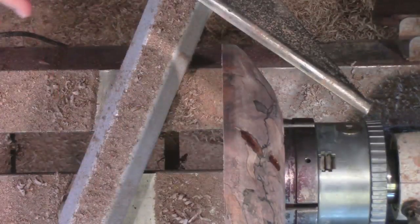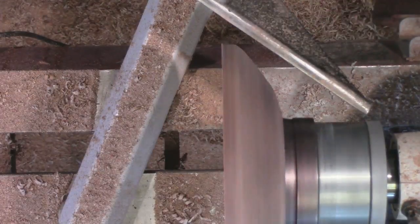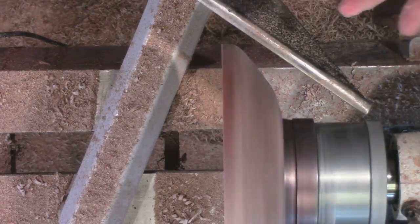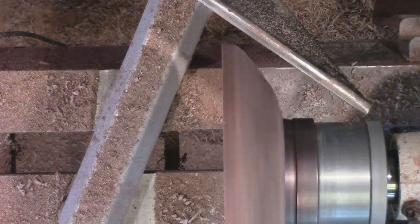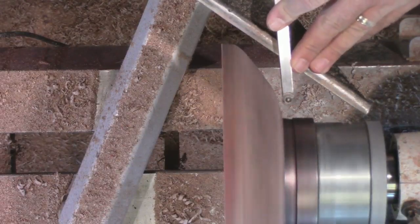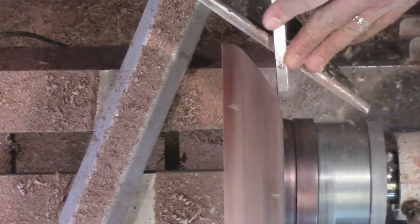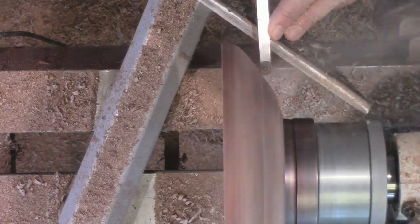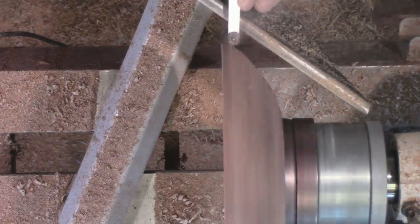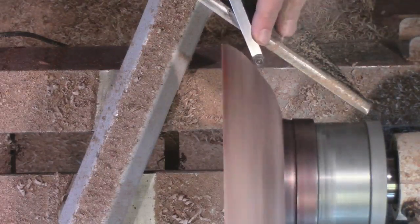But that backside is cleaned up. I'm going to change this shape right here just a little bit. I'm going to submerge the bowl, but I don't think I'm going to pack the holes by hand. I'm going to turn the resin away, even though I'm going to have some excess since I don't have a perfectly matching bowl. But I want to have a good shape before I do that. So I'm going to fix this profile right here, and I can make it anything I want, but I'm just trying to make it simple and smooth right now with a nice transition.